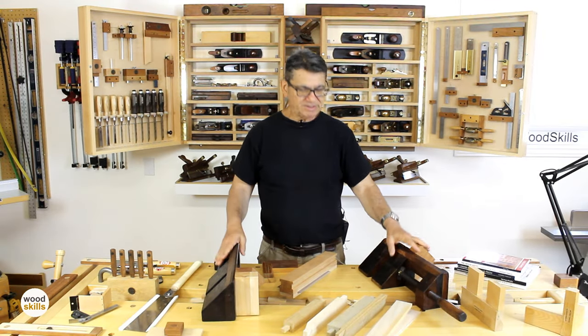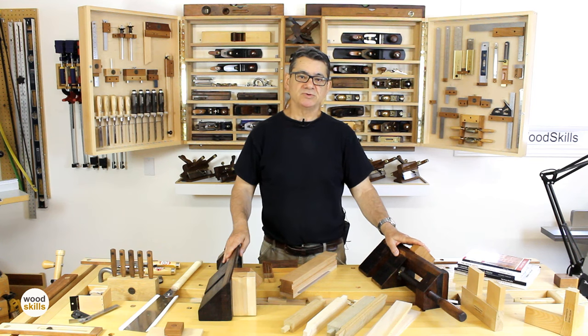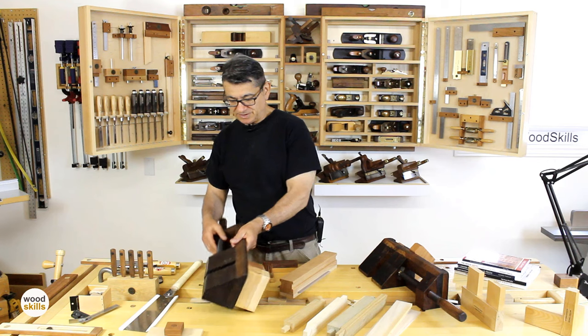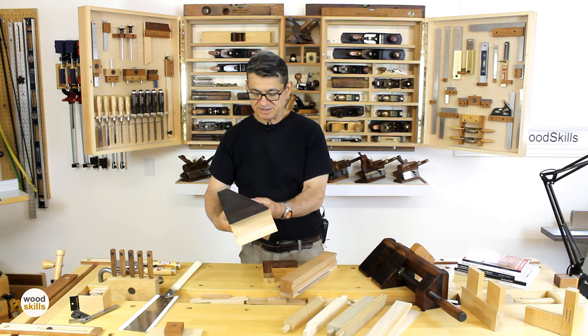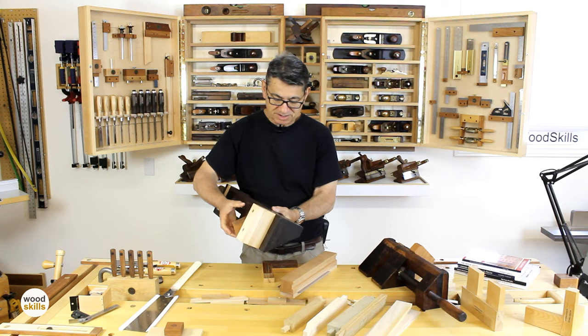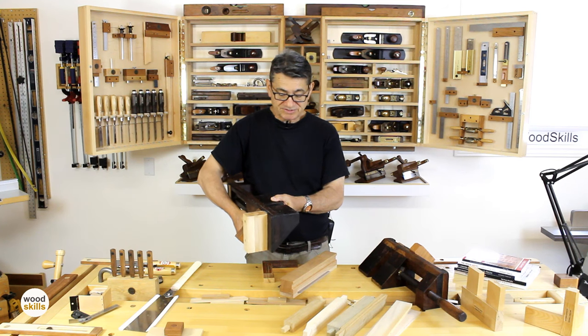So the miter jacks create precise miters along edges or faces of boards, well suited to case miters and squaring up tenon shoulders and cheeks, which I'll be demonstrating today. You can have it in either a 45 degree orientation or a 90 degree orientation. So I'd be removing this plug-in module and clamping this to either an end vise or a face vise.